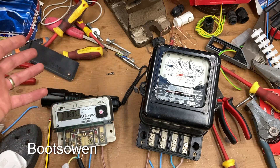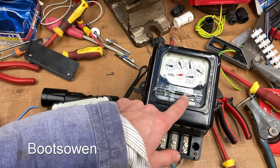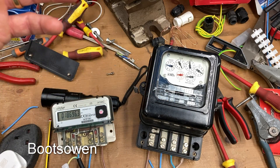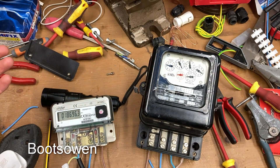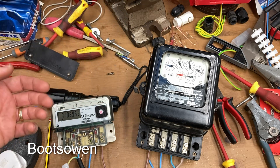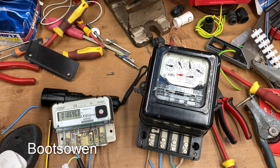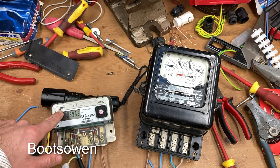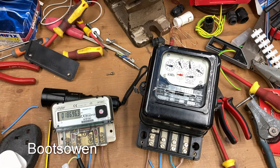What I've learned is that the analog meter runs backwards and the digital one doesn't, but it tells you with a solid red light. It took me about an hour of reading the internet to reach the same conclusion without actually knowing whether the analog would or wouldn't go backwards — they could have a latching mechanism. By doing this experiment in maybe 15–20 minutes with a bit of wire and probably about six pence of electricity, I figured it out. It's simpler just to plug it in rather than trawl through manuals for the Elster A100C with five variations of it online.